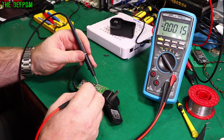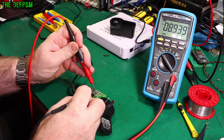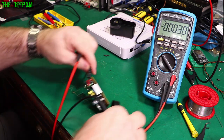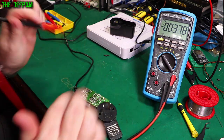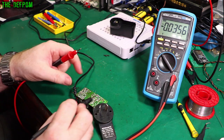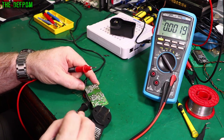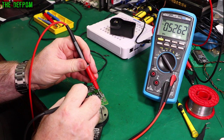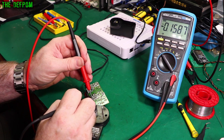There's a big capacitor right here — that's the main capacitor. It's only 9 volts so it's looking fine; it's usually the big caps you have to worry about. There's a smaller cap over here — nothing on that. Small cap here, which is probably not an issue anyway — 4.6 volts, looking pretty safe. Another cap over here — nothing on that one. So I'm going to discharge these caps by shorting them out, just to be absolutely sure. You can see it's recovering — see the voltage creeping back up.